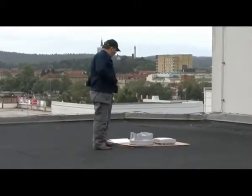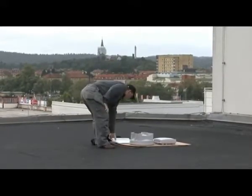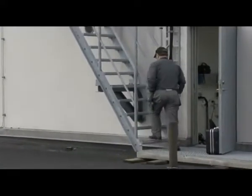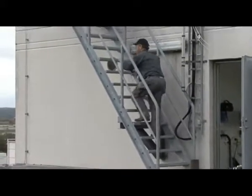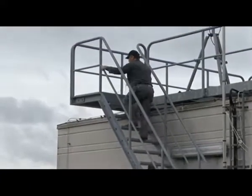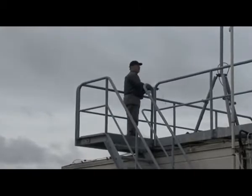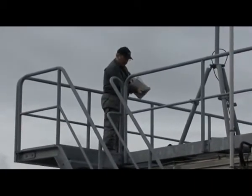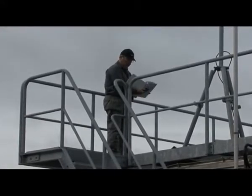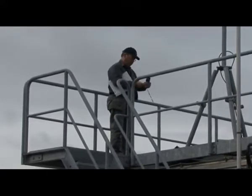You are well advised to take a close look at the installation area and consider access restrictions and even other equipment installed in the same place. Look at the direction the link is designed to be pointed and use your compass to take a rough bearing on the far end site. At this stage, you do not need to be so accurate, but just verify that the engineering information is practical.